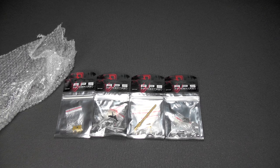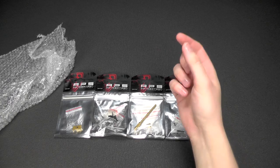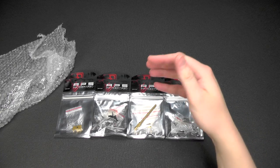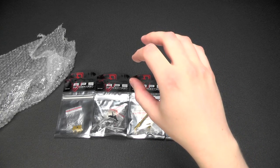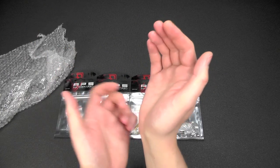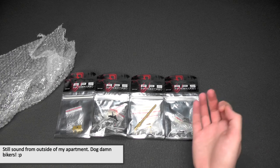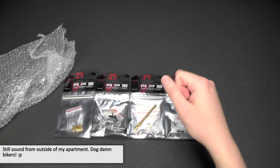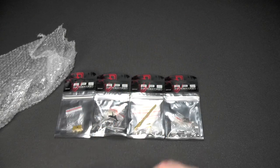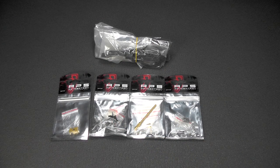Yeah, and the magazine cradle arm broke off. I was trying to tighten up the fit of the magazine tube and the barrel in the receiver. And I put three layers of electrical tape around the, there's a little indentation at the back of the magazine tube where the cradle arms sort of hold it in place, right? So I put a couple of layers of tape there, and I put on maybe one layer too much. And so when I went to put it back together, it was too tight of a fit, and one of the cradle arms snapped right in the pivot. I'll show you here in a second. So those were the three main issues that I had.